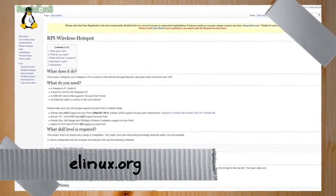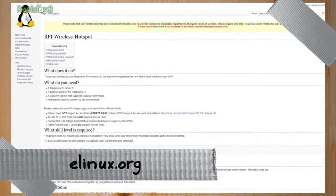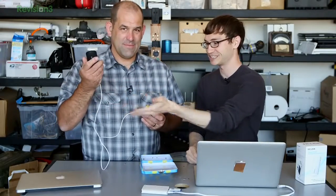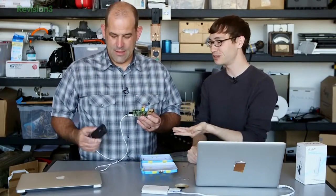Raspberry Pis are inexpensive but they don't include any form of wireless networking. We used a wireless USB Wi-Fi dongle bought off Amazon. To get hostapd up and running there's a nice little article on eLinux. If all this sounds frightening, you can either go with the TP-Link or wait until they create a boot image specifically for the Raspberry Pi. If you don't have any hardware yet, definitely go with the TP-Link version — it's so easy, has the built-in battery, and ends up being cheaper than the Raspberry Pi.